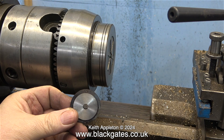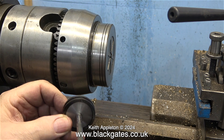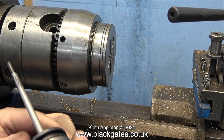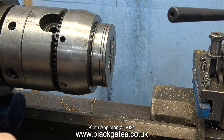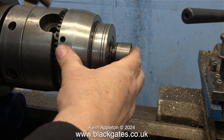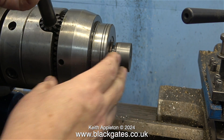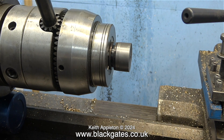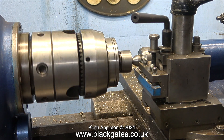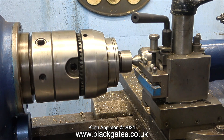This is one of the original pistons that I machined as a washer — I also drilled the middle of it so it fitted onto the piston rod. This is the piston rod that was a bit too short; it's fine for the roughing operations. I'll be using the piston rod that I made, with the centre drilled in the end, for turning the final outside diameter of the piston blank. Here you can see the arrangement — I'm using a live centre just to apply some pressure to the piston to keep it in place.